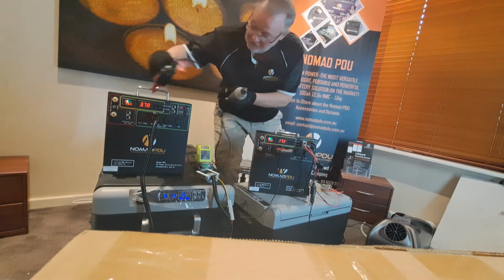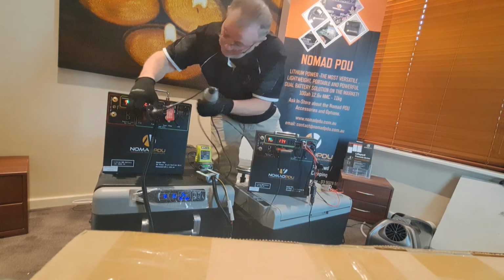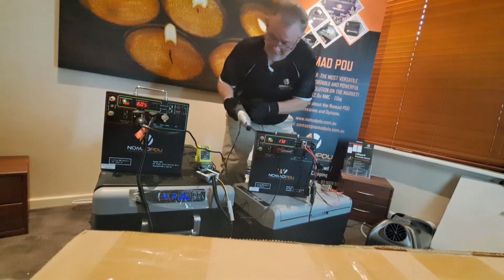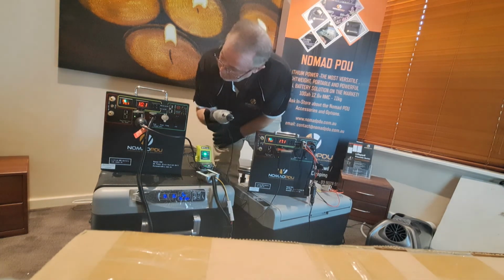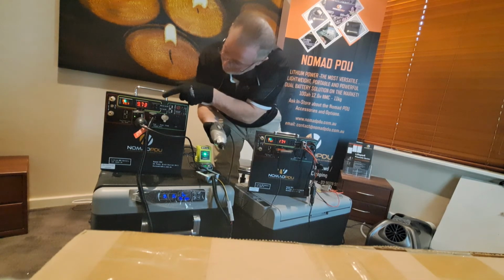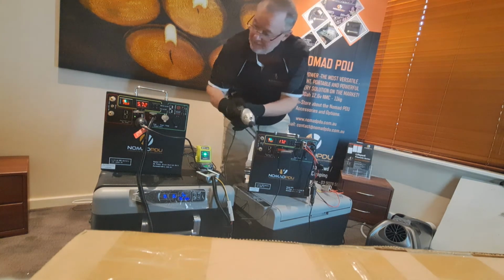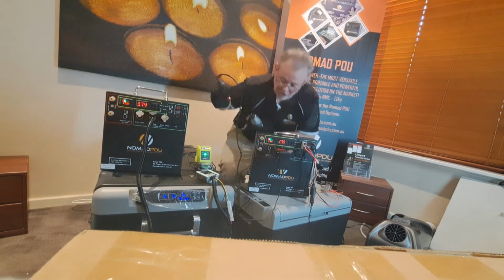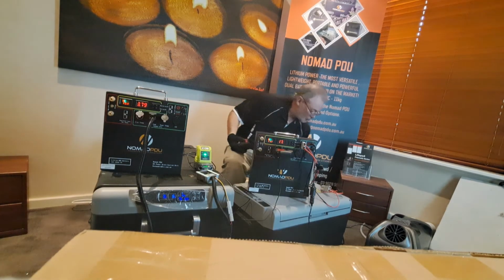But over here, because I've got plenty left in it, I could just take my cigar, plug my inverter in, like so, and run my inverter, and then I've got a Dremel running. Pulling 10 amp, that's with the fridge, 95 litre fridge running. So I can quite happily do that, as long as I stay under 20 amp. So that's how you can use pocket inverters. Pocket inverters as well, great for charging your Nomad if you get into trouble.